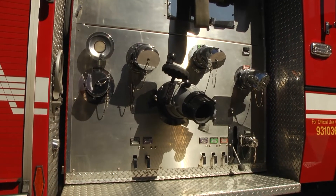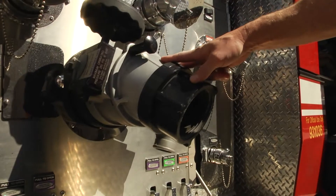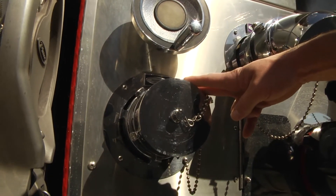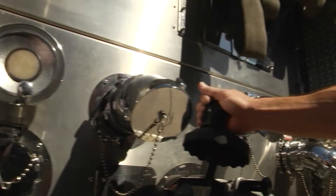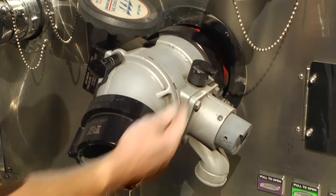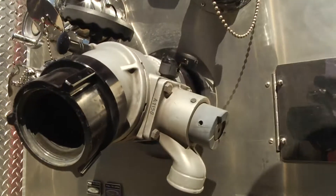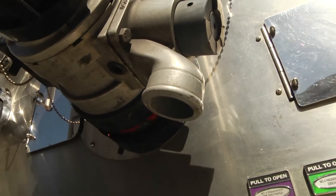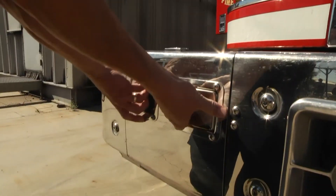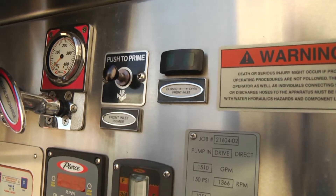For those who haven't seen the Pierce trucks, there's a little bit of difference. Both intakes are on the captain's side of the truck — that's your main intake there, and this is your auxiliary intake. That's your manual gate to open the auxiliary and that's your manual gate to open the main. There's your bleeder valve for the main and your bleeder valve for the auxiliary — water will come out right there. You also have a front intake; it's kind of hidden in the bumper. This intake is an electronic valve operated from the pump panel, just like on the other trucks — you open and you close.